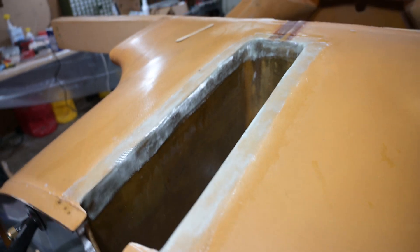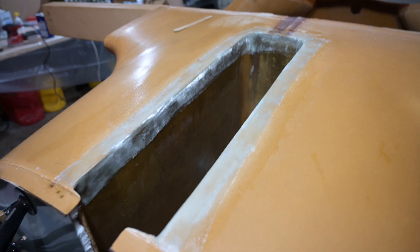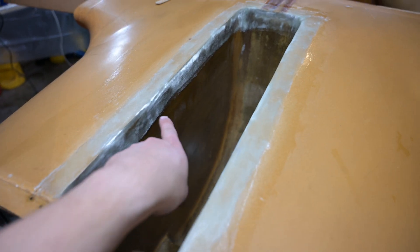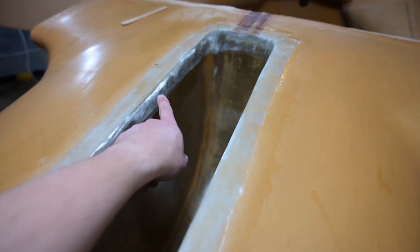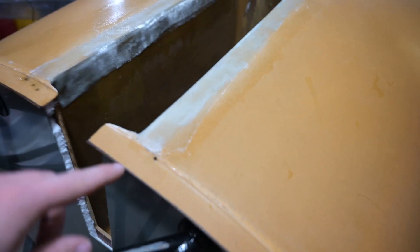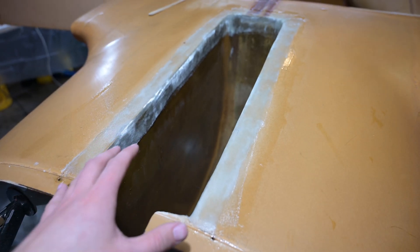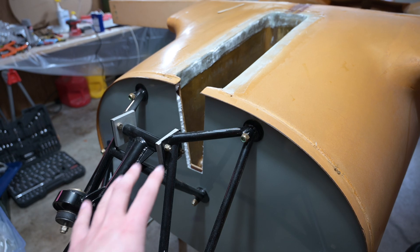This wasn't very pretty. Looks like there's some spots I missed where the fabric isn't fully wetted down. This is a two-bid layup, and there's a three-bid layup that happens on the inside - I'm going to wait until the fuselage is flipped over because I kind of struggle with these vertical edges. But for my first layup on the plane, I don't think this is horrible. I'm probably going to pour a little bit more epoxy and just wet out the areas that you can see are definitely not saturated. While this is drying, I'm going to get started on the BL50 little end ribs.